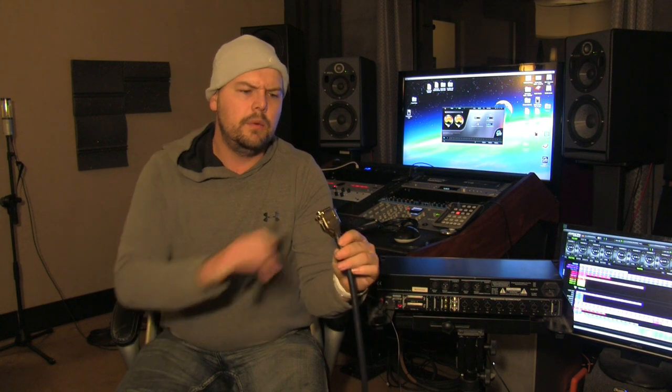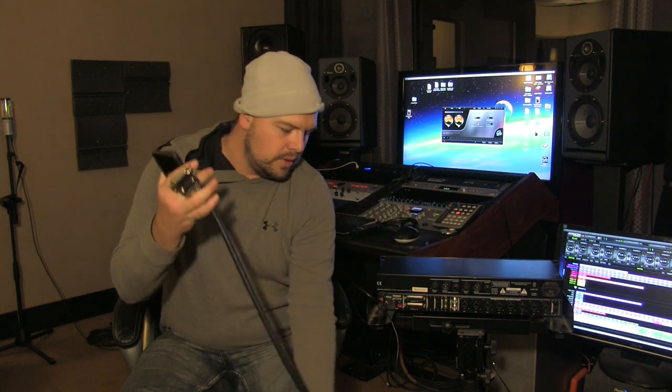What these pins correspond to is positive, negative, and the actual ground of an XLR or a quarter-inch. If you look at a quarter-inch cable, tip, ring, sleeve is positive, negative, ground. So each pin corresponds to that, and that's all that is. It can carry eight channels of analog information. Don't get confused, don't get nervous about it.